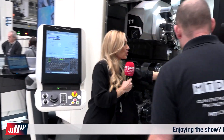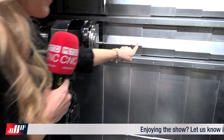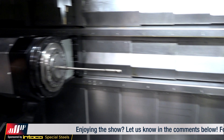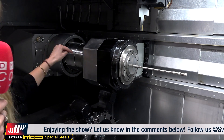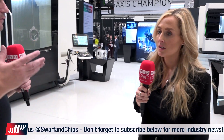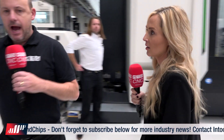Why do you need four turrets? Is it about time? Is it about access? You could be machining here, but yesterday it was machining on that spindle on this side, and also machining behind on a long part. These are medical sector parts — there are lots of areas on them that need machining. They're complex; you need to get to difficult areas. If you can do all of those operations at once without taking the part off the machine, that's the key advantage.